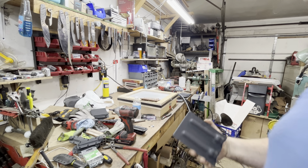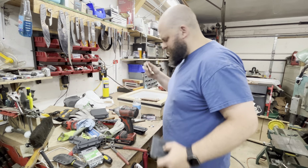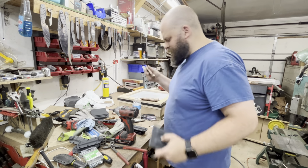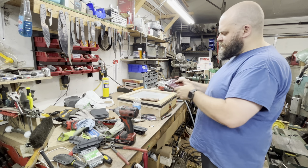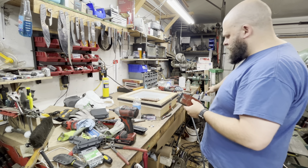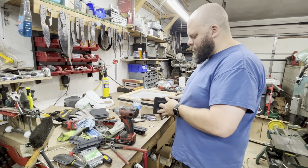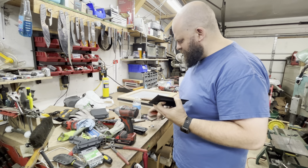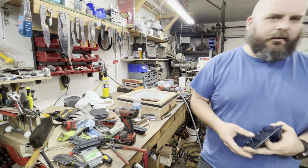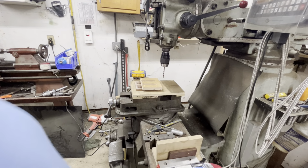As you can see. Now, got a couple things we need to do. I've got a couple of trim dies that I'm eventually gonna put in place like this, and then I'm gonna split these 2 pieces apart and route the excess material off with a flush trim router. But before I do that, I want to go ahead and drill my holes in. So I've made a separate mold, which I'll show here at the drill press.